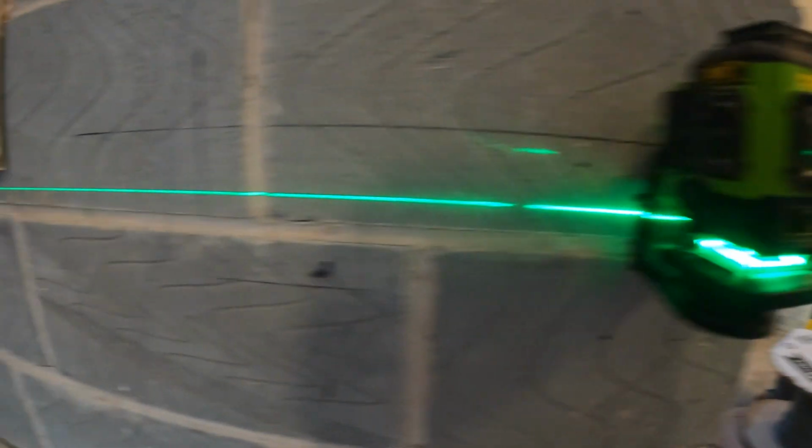So then, garage, it's going to be over this section then, isn't it? Mainly. So I'm hoping it's not all chipboard. I'll have to get a proper driver to get that up. But yeah, if it's all chipboard, we'll have to take out some big grooves. It's a bit of a nightmare to work with, because the glue is stronger than the chipboard. So you have to pull it up and it just mushes the board. It's a nightmare. But let's see how we get on.